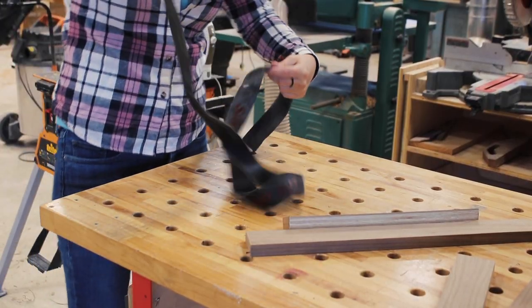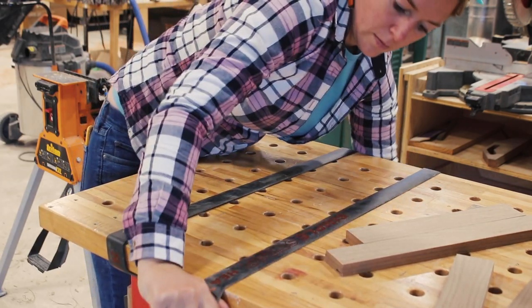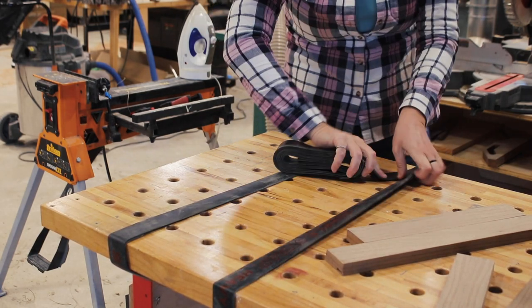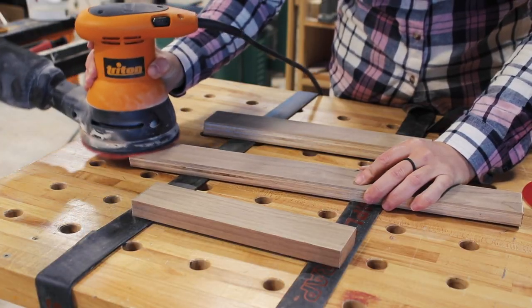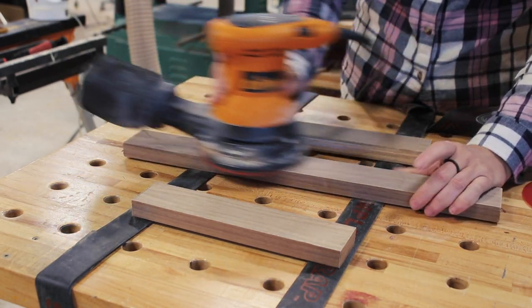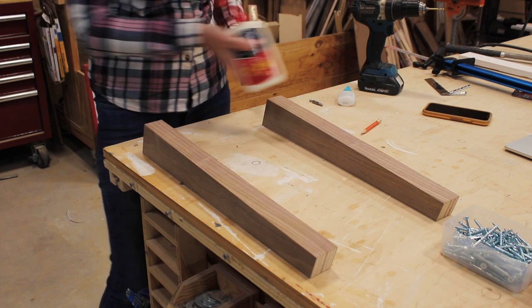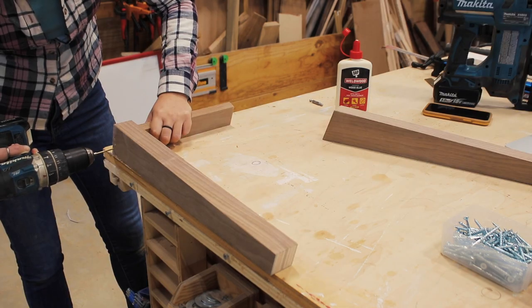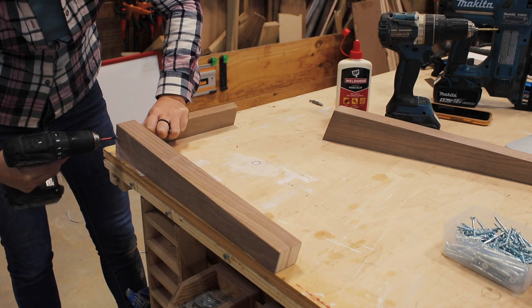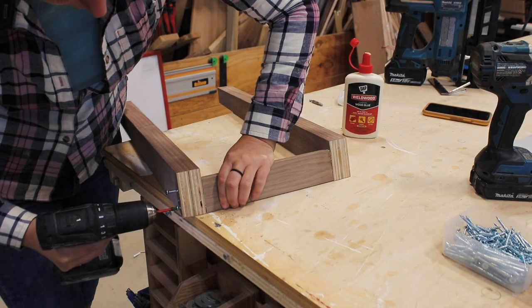While that was drying I started prepping the legs to be attached, which first needed sanding. I grabbed a roll of simple strap — which you normally see me using to tie boards down in my truck — but since it's rubber and stretchy I decided to wrap it a few times around my armor top and use it as a sanding pad. I used 220 grit to make sure I didn't sand through the veneer. Now on to making up the leg assembly. The main thing to pay attention to is the direction of things. Each leg needs to be facing the correct way and the structure connecting the two has a matching bevel that also needs to be facing the correct way. I used a little bit of Weld Wood here and two screws per joint, making sure to countersink the screw head so I could plug them later. I repeated that process to create the other three sets.